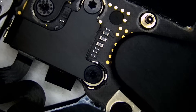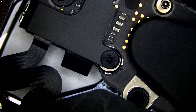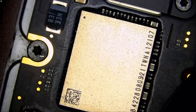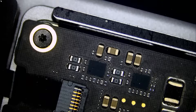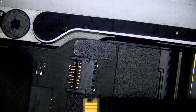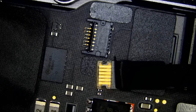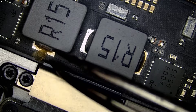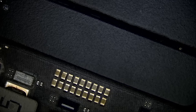The next thing I want to do first is a quick visual inspection. I want to see if there's anything blown, anything corroded, liquid damage. Anything obvious? Maybe the customer opened up the laptop to do something and knocked off a component by mistake — we see this a lot. I have a lot of videos showing how visual inspection is really important. A lot of devices, we figure out faults by just doing a visual inspection. It only takes a minute.